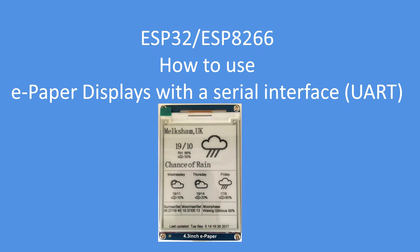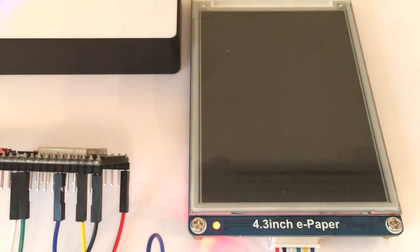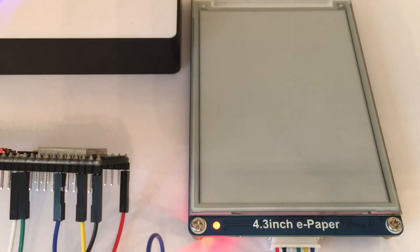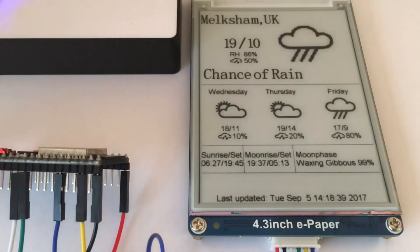Here's an example of it running. Note the time — it's 14:08 and 37 seconds. I've woken up the display; the LED is on at the bottom. The ESP32 has just woken up and it's reading weather underground data, and any second now it's going to transfer that to the display. The imagery comes from the SD card, which I've transferred to the flash RAM on the display card. And there it is — ten minutes later, a few seconds added. It's remarkably quick for a serial interface.